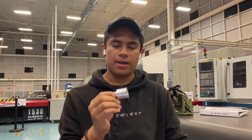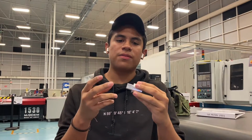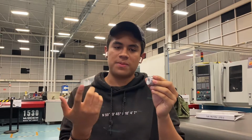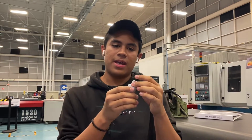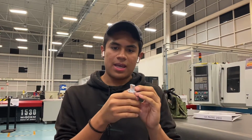This is the piece number 2, and for this piece we use both milling and turning. For the turning part we use tools for facing, roughing, finishing, and cutout. For the milling part we use two different setups. The first setup was the one where we made a Poka-yoke that will be assembled with the first piece, and also the counter where we did a little grooving. And the second setup of the milling part was the other Poka-yoke that will be assembled with the third piece. And all this setup was made so the tools will reach all parts of the manufacturing design.